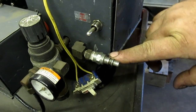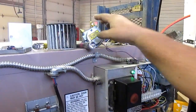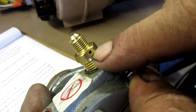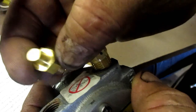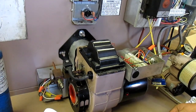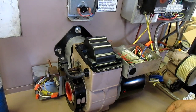Especially on a Shenandoah, if the incoming air is too low, the burner will not run. On a Reznor, Energy Logic, Black Gold, Warm, Fornax, and Omni, you should feel compressed air coming out the excess bleeder hole. It bleeds down to the proper pressure for different sized furnaces. Reznor has an orifice that bleeds off excess pressure from the air compressor. You should be able to feel compressed air blowing in your face two to three feet away from the bleeder on most models. If not, the air compressor could be bad. Be sure to fix all air problems before proceeding.